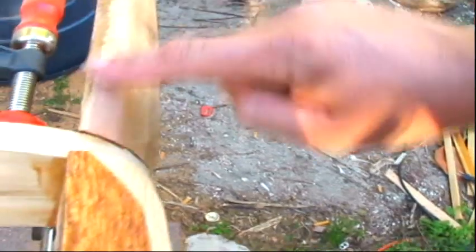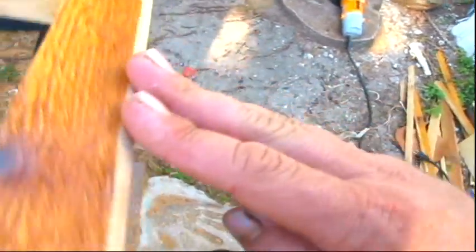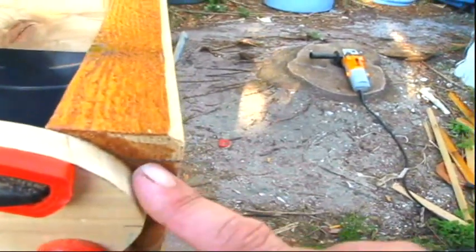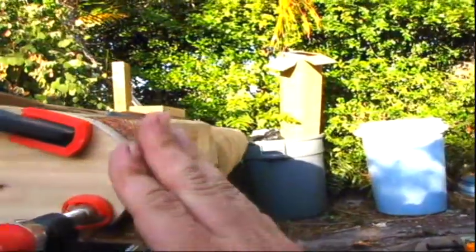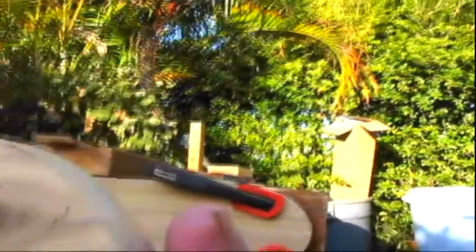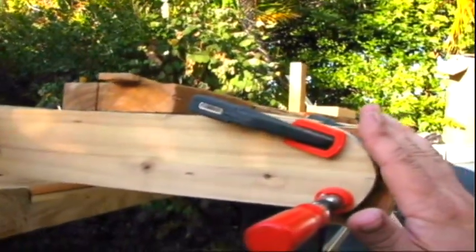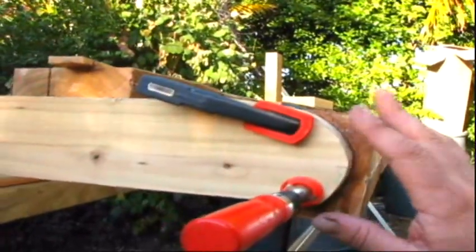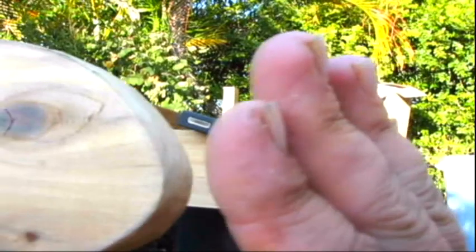Here's another demonstration of the grinding work — after and before. Now a little bit about radiuses: you need to work this into a radius. You've got a radius going into the nose from the outside, going from left to right, and you also have a radius going up and down, so you're working with two separate radiuses all at the same time, and it really makes that part of the process very complex.